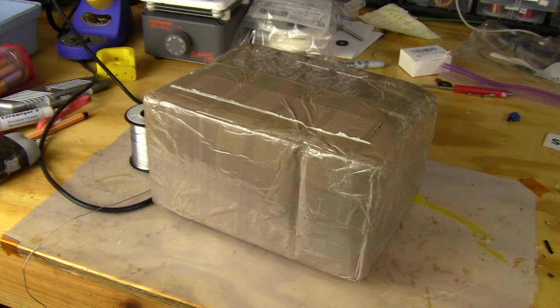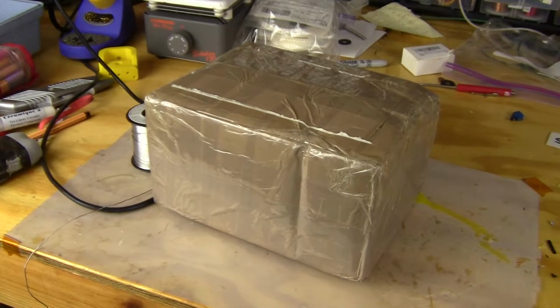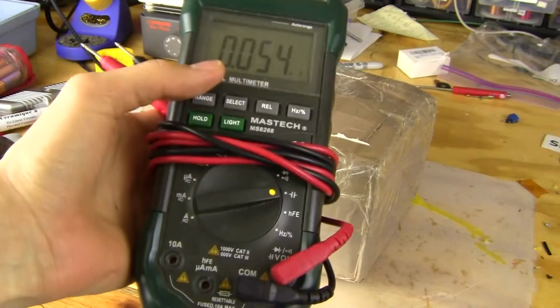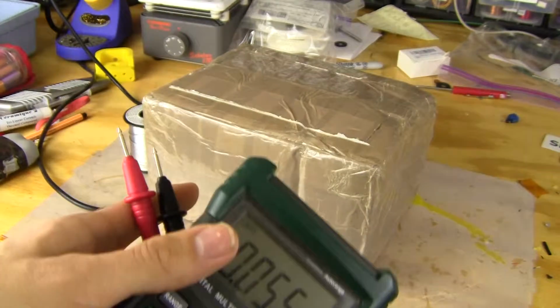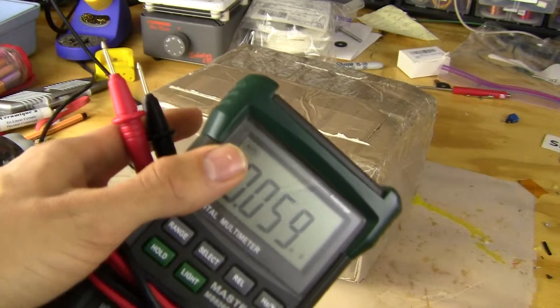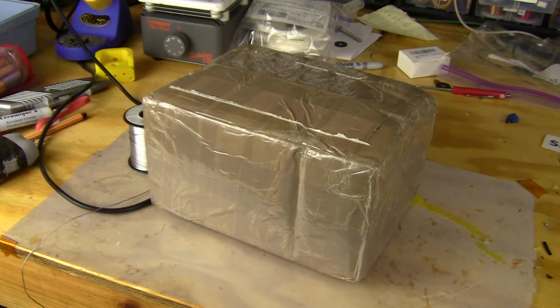I thought that was a pretty unique range because my multimeter that I currently have only goes up to, I don't know, I think it goes up to a farad, but this multimeter's lowest range is 2 nanofarads. While this one over here, its lowest range is 1 nanofarad with a 0.1 picofarad resolution on that range. And the multimeter only goes up to 200 microfarads.